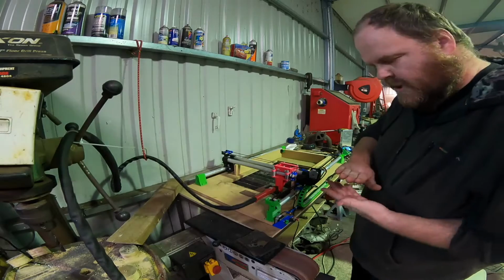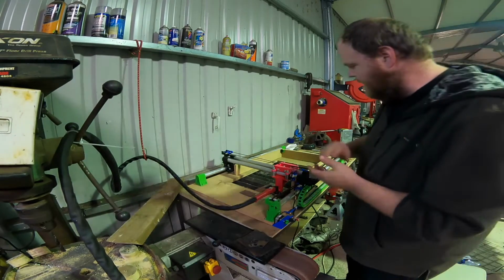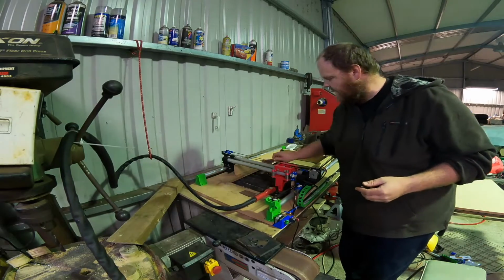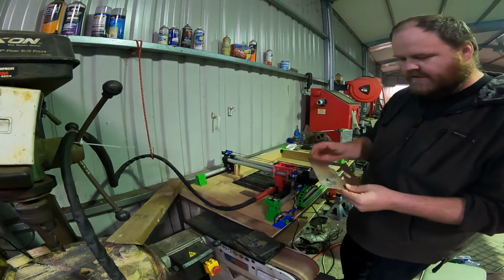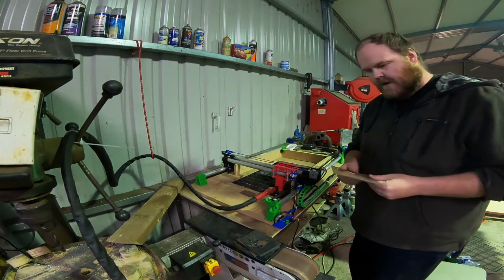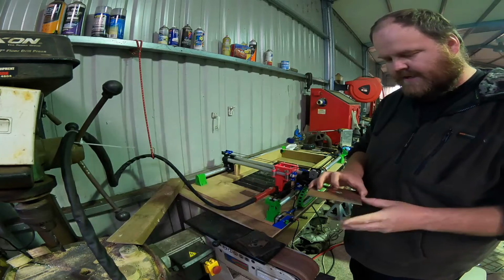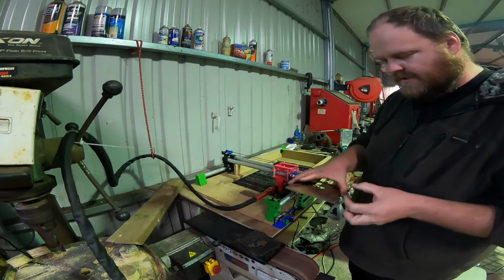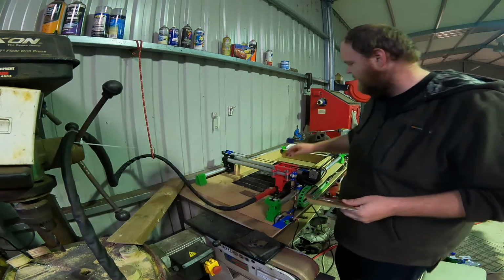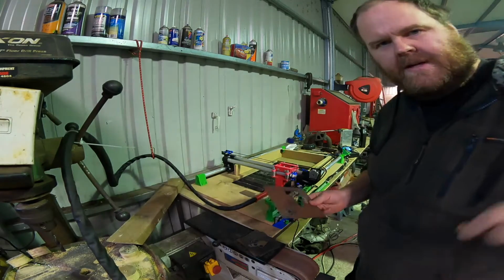So what happened there was the nozzle actually hit the steel, so I'd assume the steel's probably warped up or something, or there could even just be a bit of slag on top of these rails, and so it dragged this off with it. So that's a bit disappointing, but I do have in my mind a plan to make up some clamps which I can use to clamp this down to here to stop it from sliding around. So maybe we'll move on to that one next.